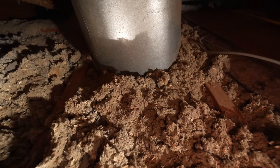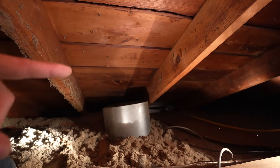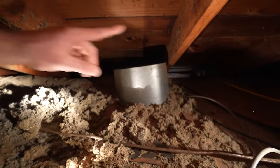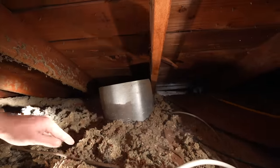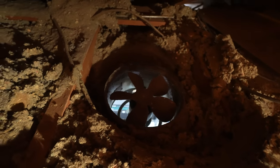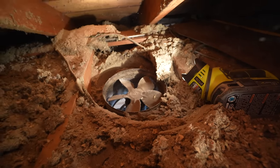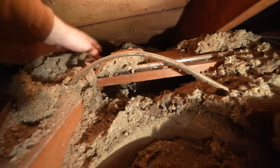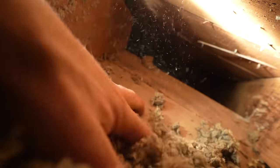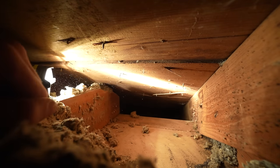Up in the attic I can see the ceiling joist on either side of the vent fan, and this seems to match the joist locations found with the stud finder. The rafters aren't going to interfere with our venting as long as we stay in between the two ceiling joists — we'll also be in between the two rafters. I'm going to make sure I cheat left of this joist for a little extra clearance around the rafter. Back here I've got no wires to worry about. To make sure my left and right alignment is dead on, I'll drill a reference hole with a quarter-inch bit so I can see it back in the kitchen.